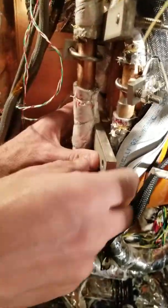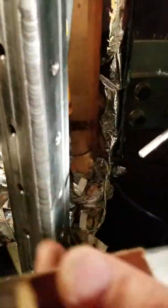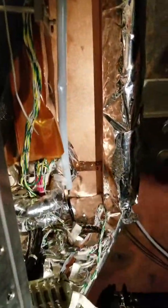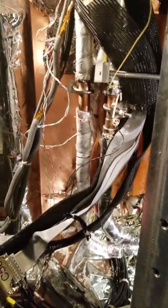Put your hand out right now - slide it right out. There you go. That even has the micarta or anything - you see that, it's all insulated. You see the bolts have anti-seize on them so you don't gall them up, because you're cranking them up pretty hard. And this is the thing that's keeping the buses together - this is the clamping force to keep the contact.